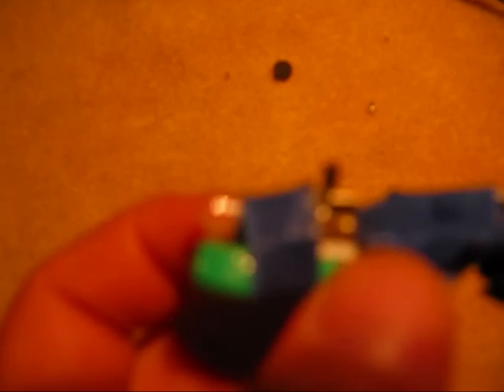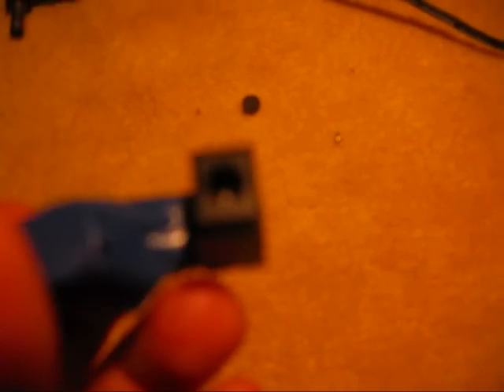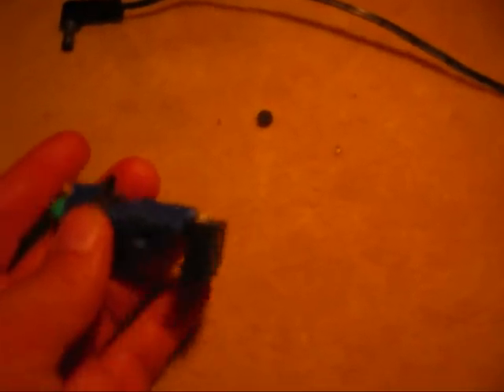Okay, this is my second model — here's the old one, this is my second one. Basically it's the same thing but it's a little more compact. I'm charging it right now. It's the same thing but a smaller battery — it is a 3.6 volt battery but only 40 milliamps. LEDs take about 50 milliamps so this will last almost an hour. I found the board at the side of the road. I put the switch on and it's only one LED, and then the same plug — it's the same thing, 12 volts down to about 4.5 volts.